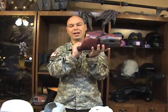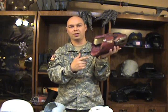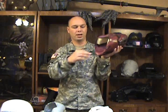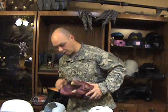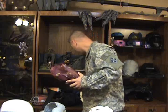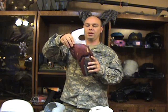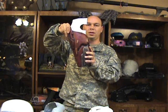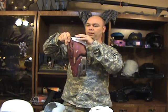From the inside, you're going to build up with either clay or cardboard coming outward. Let me give you an example of what that would look like. I'm trying to do this real fast. Take your paper, put it in there, hot glue from the inside. That's now extended when you do your mold.